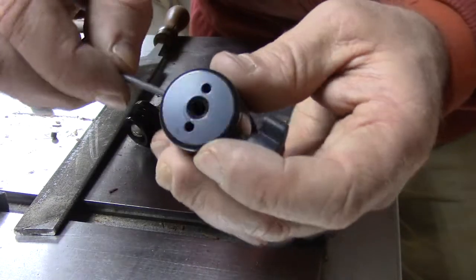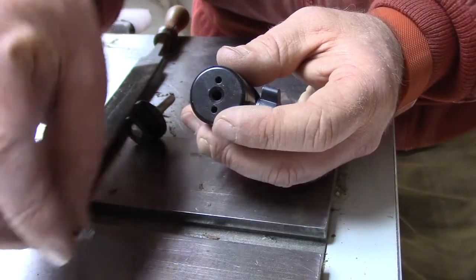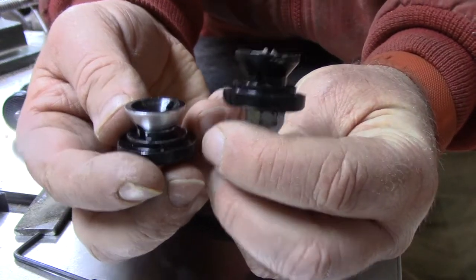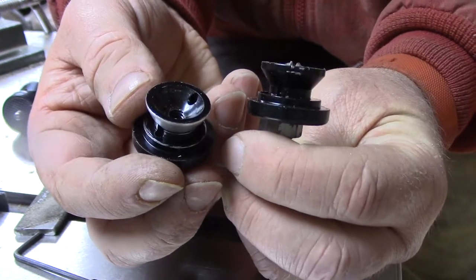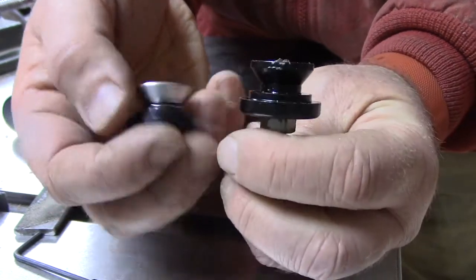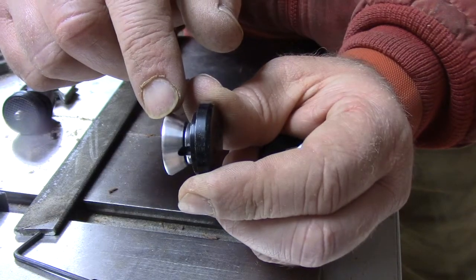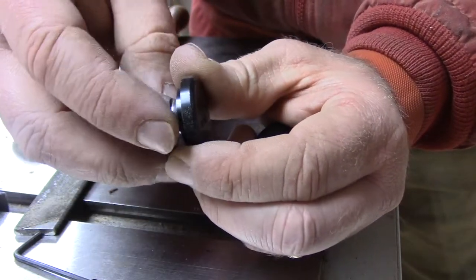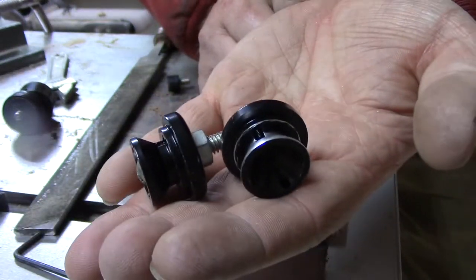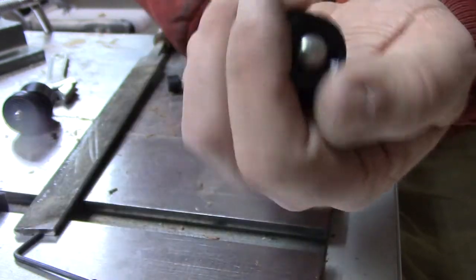Now this is one I've already fixed, so I'll show you what it looks like when you take it apart. You're going to need to put a drop of super glue on that set screw too, once you get it set. See the difference? You can see the flat, you can see I've machined it off. I filed it in the drill press, carried that to the outer edge, sanded it smooth so it doesn't bite on anything, and they're done. That's how you can fix them if you've got these horrible things — you can make something a little less horrible, and put your pennies in your pocket where they belong.